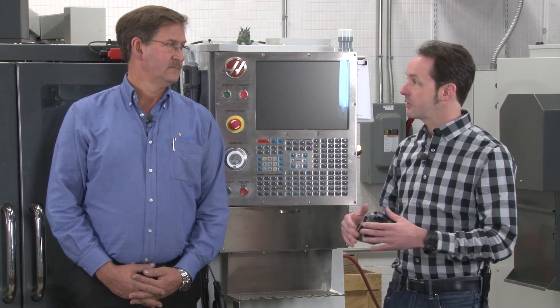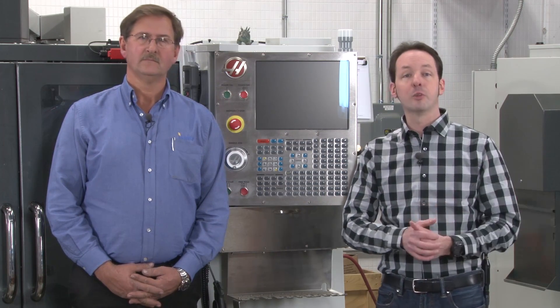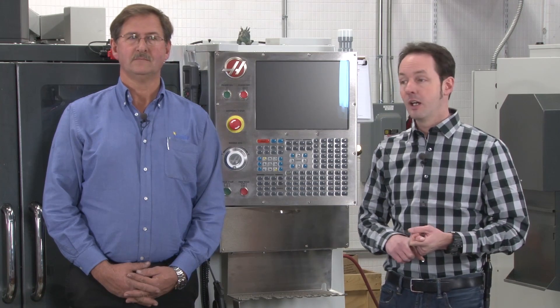For our big facility here, we've got a large air compressor in the other room, an air dryer, and all kinds of plumbing — so that's sorted out. You also have to make sure you have the right power, which depends on the machine. Our machines are on big three-phase 480V. So you've got the air, you've got the power.